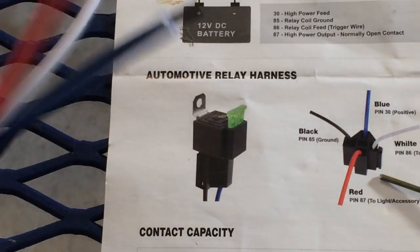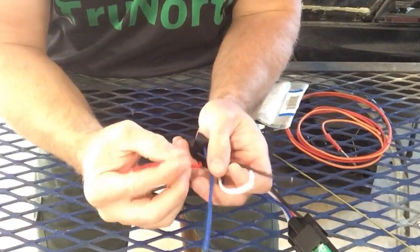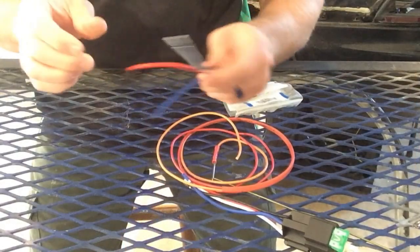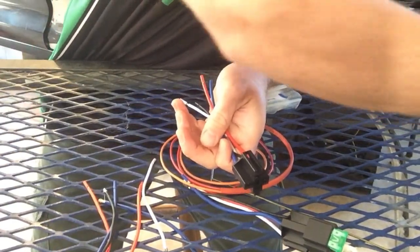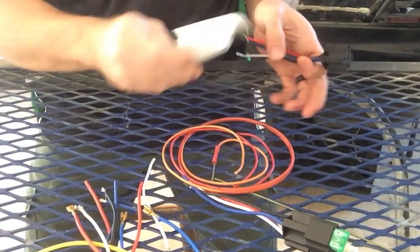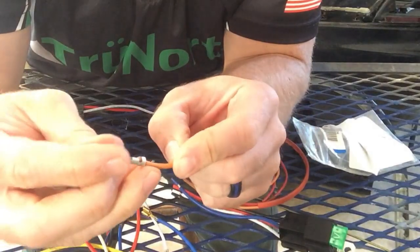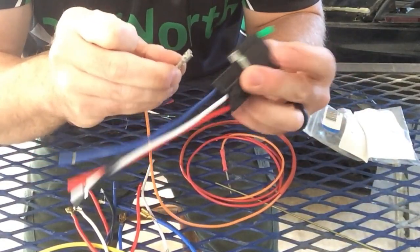Now, which brings me to the wiring ends and how to make this look tidy. You do have a few options when wiring these together. One option is using butt connectors or soldering the joints together, which is kind of tedious — at the end of the day you have a whole wad of four junctions soldered or crimped. What I like to do instead is completely remove the existing crimp connectors from the unit. You can buy the exact same crimp connector that comes with these units. Your next move is to wire your components together the way you want them, run these crimp connectors together so you only have one joint that gets hidden inside the actual relay section of this unit.